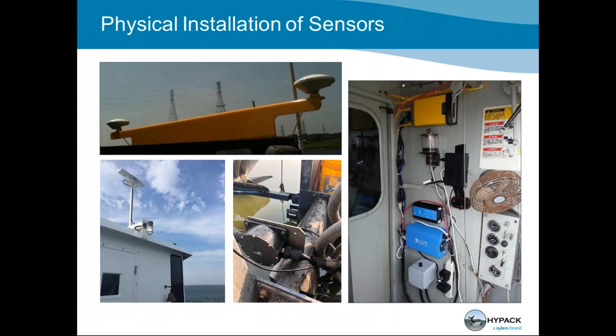If we look at the physical installation of the sensors needed on your dredge, it could be done a number of different ways. With the simplest of installations, top left, you're seeing two antennas — it looks like a Trimble system. They specify the antennas should be two meters apart. Give it at least six or seven feet for sure, so you'll have better heading for your dredge body. If your two antennas are too close, it increases the error budget and your heading might be off. The farther apart, the better — at least two meters. Bottom left, you see a Hemisphere Vector series, which actually has two antenna heads within that single casing.